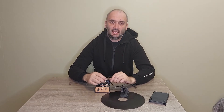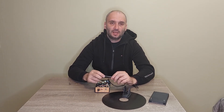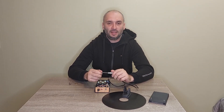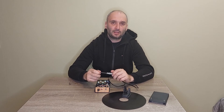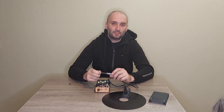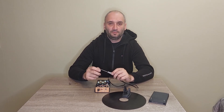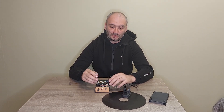The same procedure applies for the big frame with the DIPS program, but you should go away from houses and other metal objects, because the big frame can sense up to five or six meters. There should be no metal around the coil within that range. In this case, we recommend using a tree and placing the coil on the tree, then performing the tuning. You can test it with a large piece of metal, around 30 by 30 centimeters or bigger, and the settings are made the same way.